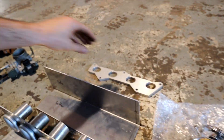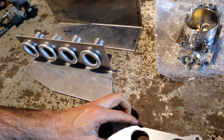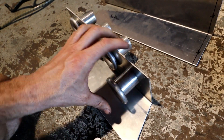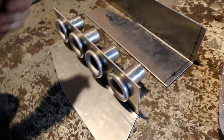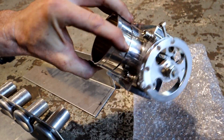So we've gone ahead and started to make our own manifold. I've got a 10mm aluminium plate laser cut — that's going to be our flange that bolts on the side of the cylinder head. I got these velocity stacks online, and we went ahead and used the dimensions off the Chinese manifold so we could replicate it, and just got a universal throttle body — that's 75 millimeters. So we're going to bang this together, get it back on Nick's car and see how much power she makes.